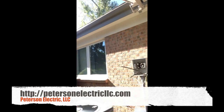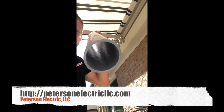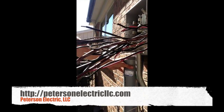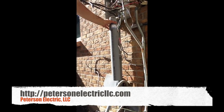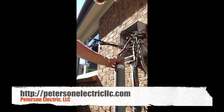On these underground feeds, you've got to put in a slip sleeve now. This is a slip sleeve — it is a two-and-a-half-inch conduit that will fit over this conduit right here. It allows for the expansion and contraction as the ground wants to come up and down. It allows it to slip, hence the name: it's a slip sleeve.